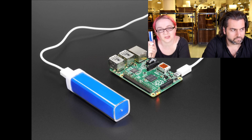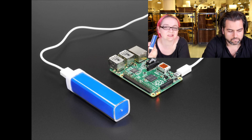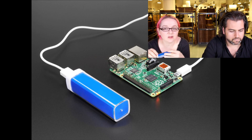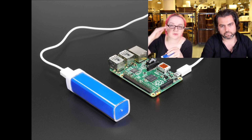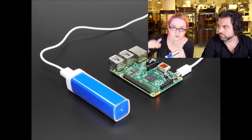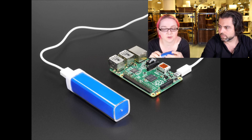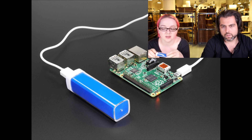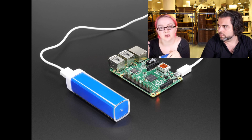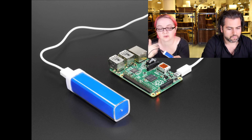The other ones drooped or were really noisy. This one is a guaranteed 5-volt. It's a little more expensive, but it's the real deal. There are all these little slim ones, but if you actually measure the current output, as you get beyond 300 milliamps it starts dropping really fast — you don't get a nice steady 5 volts. This is the Pro model. It's a little more expensive and a little bigger, but way better quality. It's really good for powering Arduino projects, Raspberry Pi projects, BeagleBone projects. It's rechargeable.